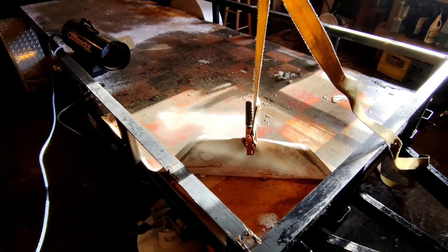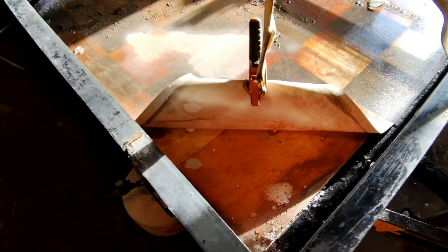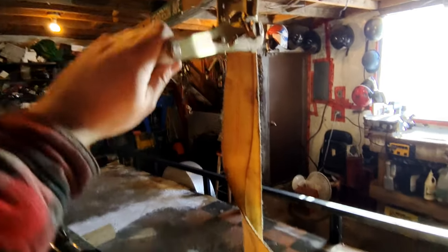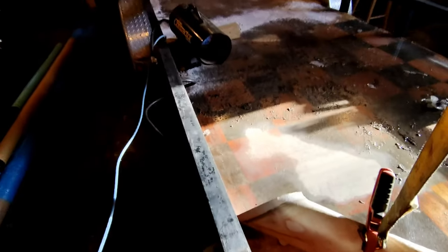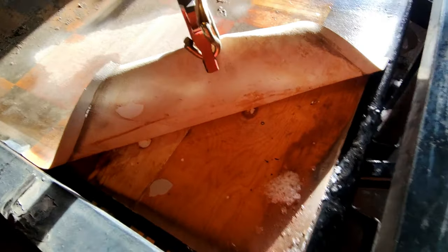So the plan for taking off the vinyl - it's glued down, and I want to keep the plywood. So we've got a ratchet strap going up to the roof, a clamp on it, and the heater on it to warm up the area. Then we put some pressure on it and it slowly, slowly comes up.